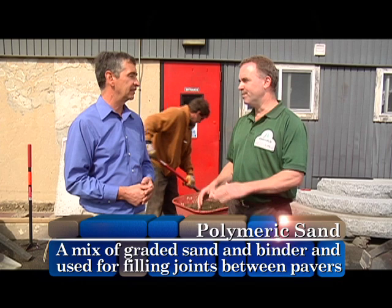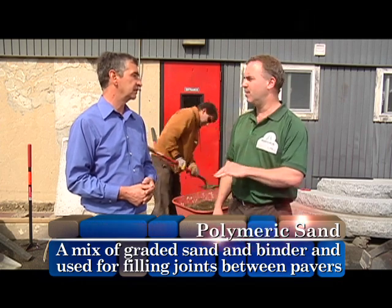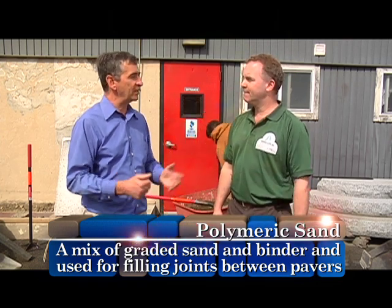Once the cable is in, we end up putting the pavers down. Normally, once we're done with the pavers, we put a product called polymeric sand, which helps seal all the voids. However, today we had some rain that made our pavers wet, so it's hard to use that product — the last thing we want is to put that sand on a wet paver because it'll gum all up. You need dry conditions. So that's one last thing Dave has to do later, and we're almost ready to get started on the rest of the project.